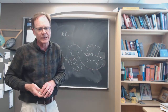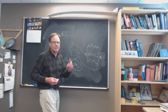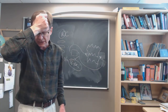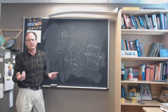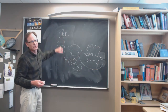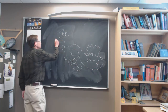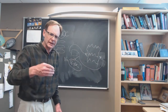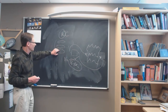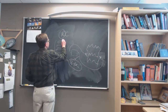For the RC timing part, we have those three larger resistors that we didn't work with before, but we now have enough sensitivity with our new meters to measure their resistances the same way we've been measuring the others. I'd like you to precisely measure the R value for those three large resistors — I think they range from 22 kilohms to 100 kilohms. Measure the current and the potential across each resistor at various potentials using Ohm's law, and get an R value with uncertainty as precisely as you can.